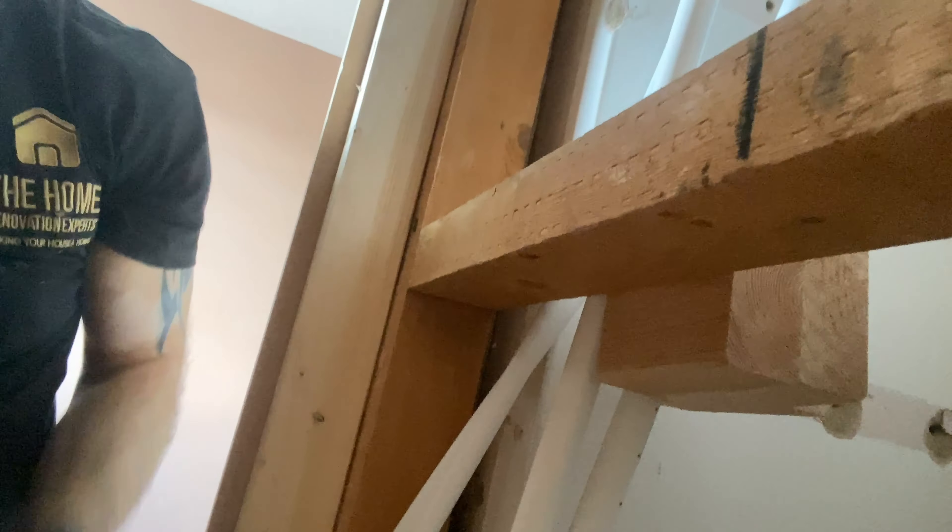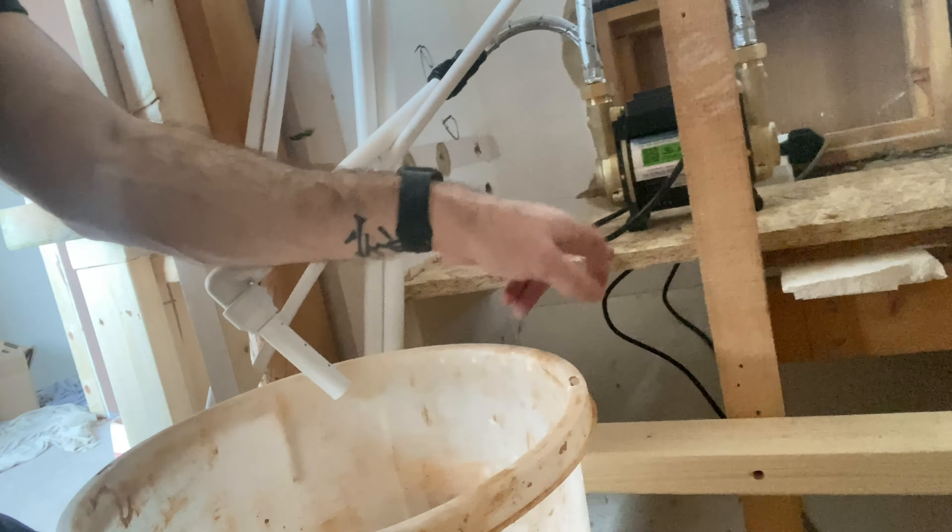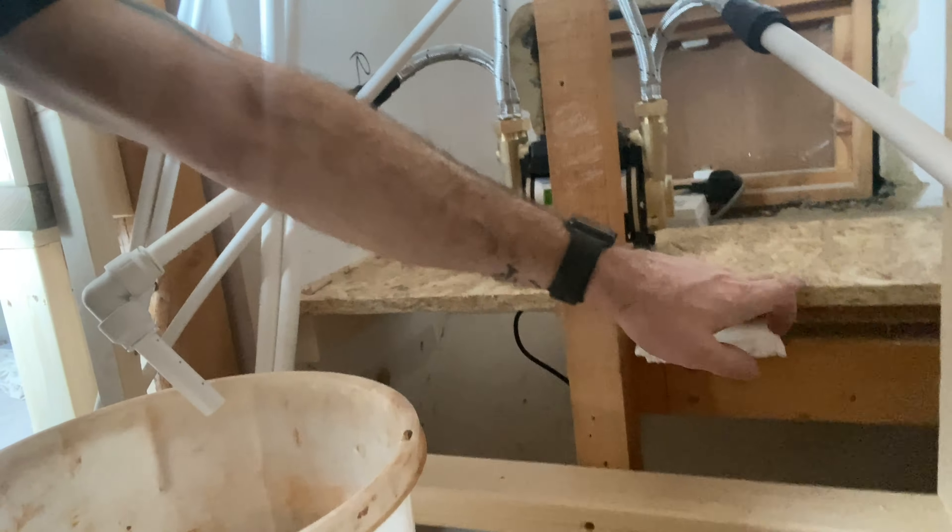The cold side is absolutely diamond as well - good flow, there you have it. Both hot and cold sides now completely bled, which is amazing. Now I'll take off my temporary pipework and connect up to the verticals - the feeds for the shower and the bath - and then that's the pump in and primed. I had to extend the bridge section here because the pump was just over and bending the flexes, which I wasn't happy about, so now it's all straightened up perfectly.